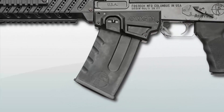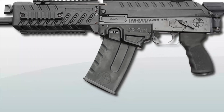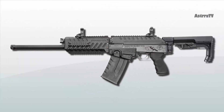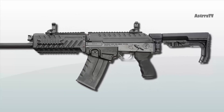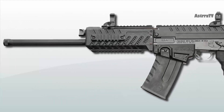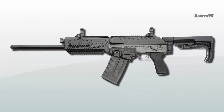The magazines are solid and built very strong using polymer bodies and steel-feeding lips. The capacity varies from 5 to 10 shells. Drums with a capacity of 20 and 30 rounds are available as well. The simplicity of the gas system allows for easy adjustments, and it's designed so that a shotgun shell can be used as a wrench to adjust for various munition types. This means you can use a wide variety of different 12-gauge munitions.